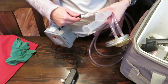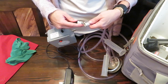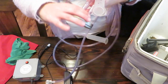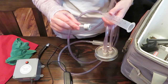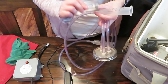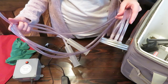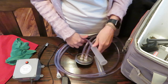This lid attachment goes on a mason jar. These are the teat cups — we're going to wash these in the sink, and this is how it attaches to the pump with a quick connect — it just snaps in like that. If you're looking for replacement hoses, we've bought replacement ones. When the hose gets really nasty, I just cut it off the barbs and replace it — it's just aquarium tubing. The quick connectors are like CamelBak-style; they're really hard to find but you can get them on Amazon — I think they're called quick-fill connectors.